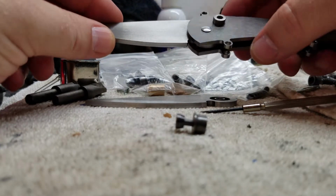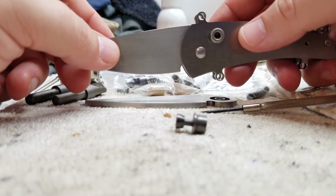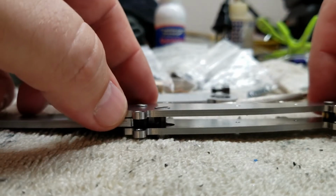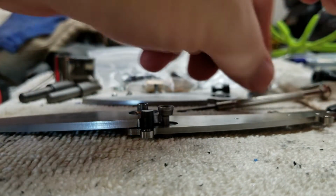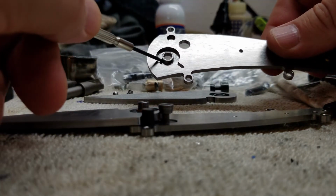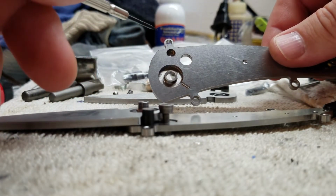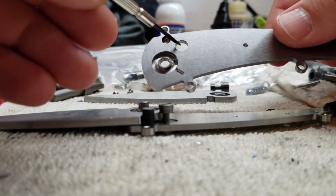So, all right, let's kind of take this thing apart so you can see what's in there, and then you'll be able to see it maybe a little bit better. Okay, so now I can flip this guy over, and we've got the backside frame piece. So we can see in this piece here, I have the spring pocket already cut out for my spring with the locking leg. I have my stop pin counterbore, so that does not go all the way through. That's a pocket that has a floor to it. And then I have the through hole. So that through hole is for the back side of the button.